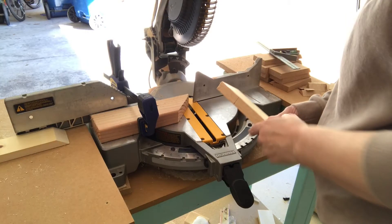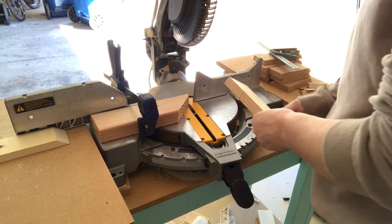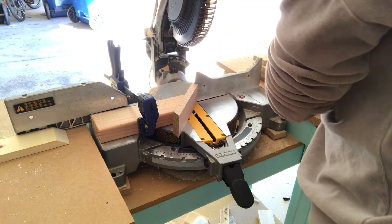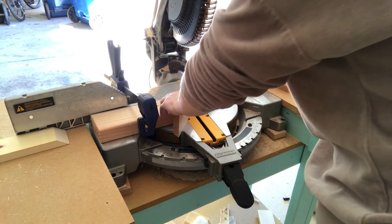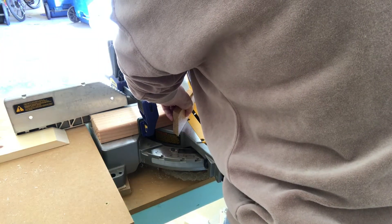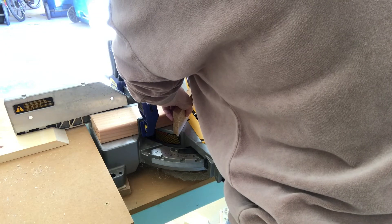Now on this next section, I'm going to slow things down a bit so that you can see what's going on. As you can see, I have a jig placed on my miter saw that's going to allow me to make a 54 degree angle cut on the end of each piece. I have a video on exactly how to make these angles or any angle and I will leave a link in the description below.